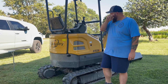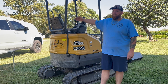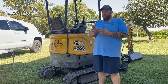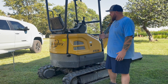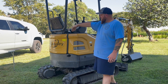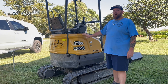So I'm just going to add a couple of 12-inch electric fans. I'm going to put one on that side where the hydraulic cooler and radiator are — sucking air in, blowing across the cooler and radiator. The engine fan will continue to pull that air through, and then I'm going to put another 12-inch fan on the other side blowing out. All cool air will come from that side, all the way through the engine bay.